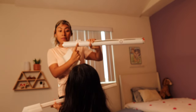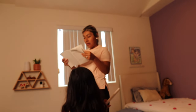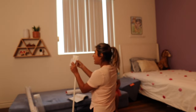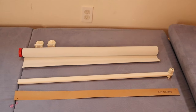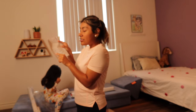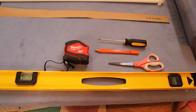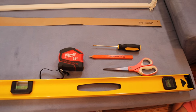The curtain roller has a red clip at the end that should not be removed, nor the paper wrappers, until the very end. I must confess I got the wrappers removed ahead of time — it was okay, but it just makes it easier to install at the very end. Brackets come in the attached box. You also get a paper strip with the exact measurement of the curtain and where the hole should be made. Here's a list of items you'll need: a flat screwdriver — not the cross one, the flat one — something to check it's straight, measuring tape, scissors, and a pencil.